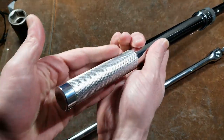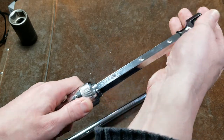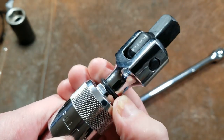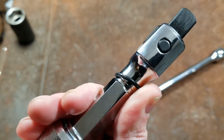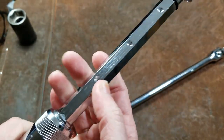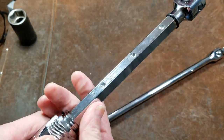You have this tube. It's interesting — this is a tube with a pressed-on cap. They do have a spring, so when you close it all the way down it kind of bounces a little bit. As well as having an O-ring there, there is an undercut. And I think if this thing breaks, it's going to be at that undercut, which is just over a half inch — maybe 550 thousandths. The hex is surprisingly enough 5/8ths — 625 thousandths.